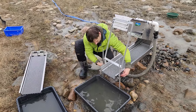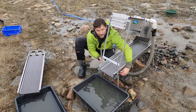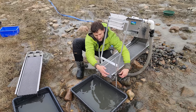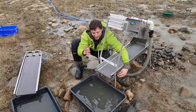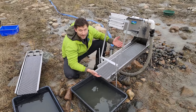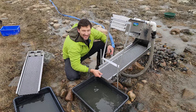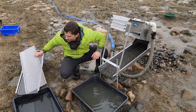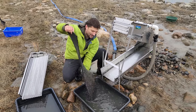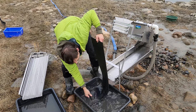The bottom tray is held in the same way — you've got these two wing bolts. They're nice and big, 5/16ths of an inch, the same ones used on the legs, so they're really good especially with gloves on in the cold. The bottom tray really comes out easily with the way the sluice is leaned out slightly on the sides. Here's your mat — fits in there really nicely. 5/16ths inch thick backed miner's moss. Does a great job on fine gold.